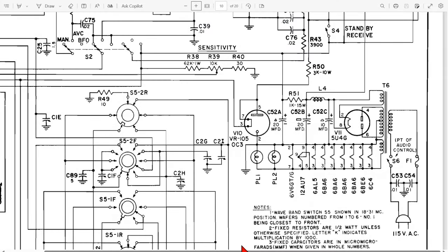Well, all right, here we're looking at the power supply of the 140, and this is one of the areas we would want to look at, and Hammarlund was kind enough to put in a fuse, and of course a switch. But we're kind of violating the ideology that the first stop to the fuse is the hot lead. And if you did that in this case, if this was the hot lead, you'd still have, even when the neutral was disconnected, hot running through the transformer, which is not a good idea. And this is where I think they went wrong. The proper ideology would be to have the hot run through the fuse, then to the switch, and then through the transformer. So we're going to rewire it to do that.